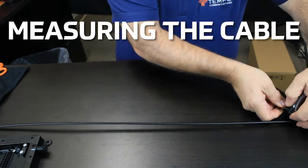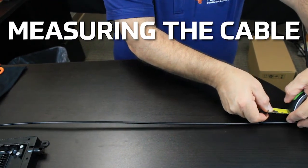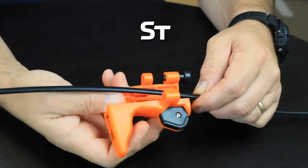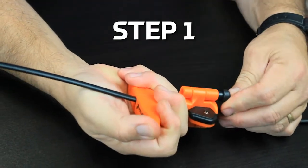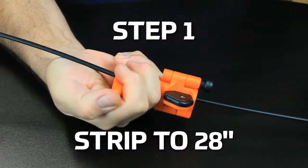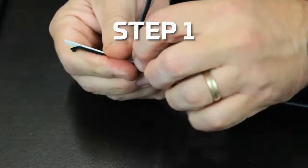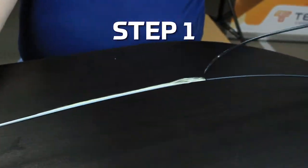We will now show the procedure for making a fusion splice in the DFE100. Step 1: Strip the drop cable. Remove the strength members and Kevlar yarn. Peel the toner wire back as applicable.